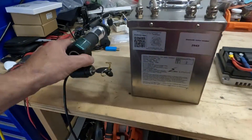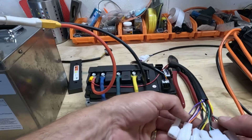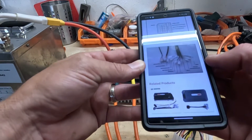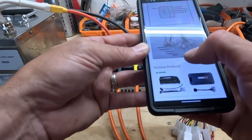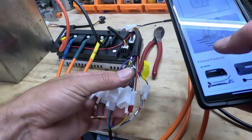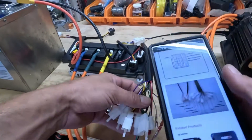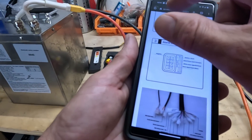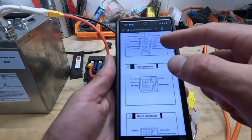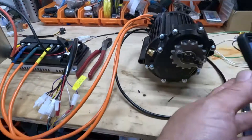Our bench test is complete — that was a lot easier than I thought. When it comes to a lot of these other connections, I have a wiring diagram and it looks like we have sport mode, low voltage, brake switch, reverse, communication cables for a display, a speedometer cable, high voltage brake, and electric power key lock — that's what we used for the purple one. You can get one of these wiring diagrams at qs-motor.com; it had the Votol EM100 wiring diagram and all the pin-outs for the connections on the controller. Really useful if you bought this off eBay without a wiring diagram.